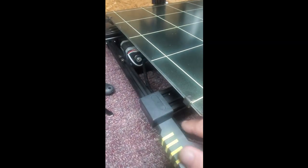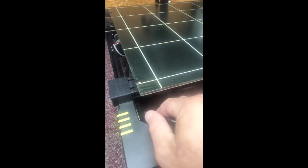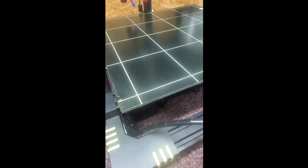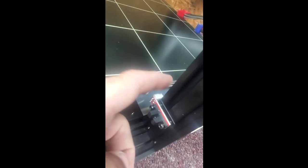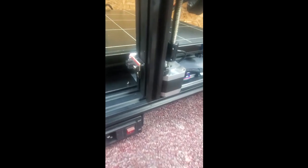I had to feed a little bit of this wire through this clamp very gently. I don't want to pull on these wires too hard, but I had to pull a little bit because it was just a little too short to go into the motor. And so now I can plug it in. There are two wires you'll plug in — one is for your motor, and then there's this one that plugs into your limit switch, which is right there. They'll only plug in one direction, so if you go to put it in and it won't plug in, it's because you've got it upside down — just flip it over. It's grooved so you can't mess them up, and they're different sizes so you can't put the wrong one in the wrong spot. Pretty easy.